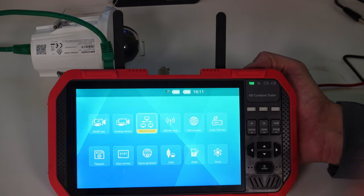Pressing mode to go home: web browser — you can open a web browser and type in a web page to connect to it, though you'd use a laptop for downloading, as it is a bit slow. Cable TDR test: connecting to the two ports here — blue and green. I've already got a PoE cable connected on the blue port and it's showing a five-meter cable, which it is — a five-meter patch lead. Attenuation only really works for cables over 10 meters. I can also test the green port and do a continuous test on those ports.